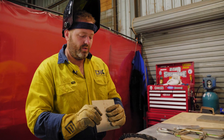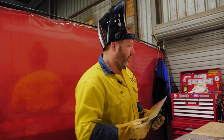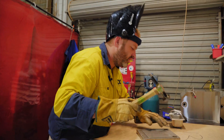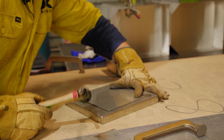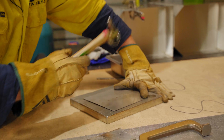Okay, now once that's done and it's all tacked, you can see it's nice and flat. What we will do is just slightly dress the two surfaces to ensure they are completely flat. It doesn't have to be hard — it's only 1.2 stainless. If we do hit it too hard, we will stretch it.